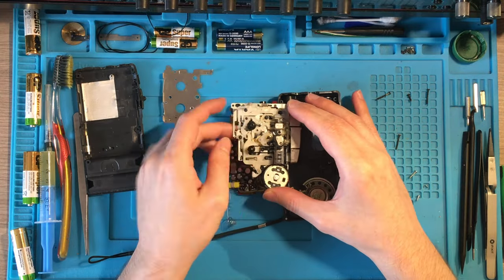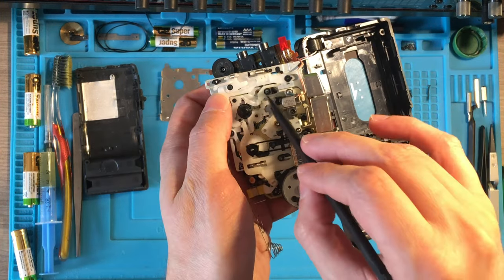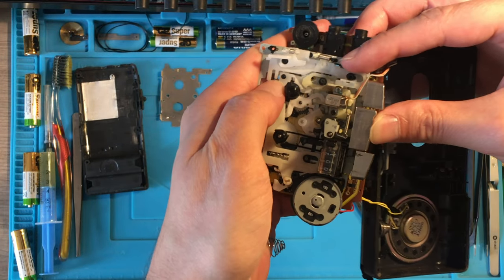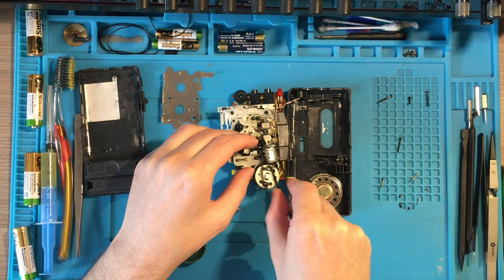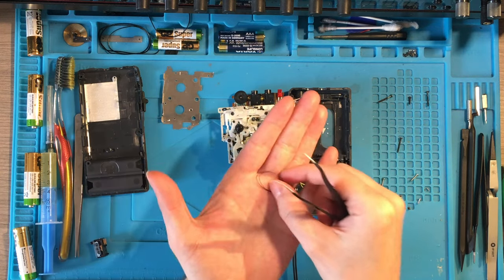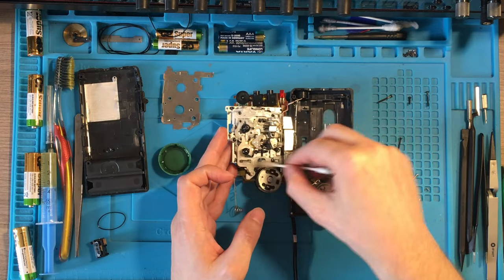After the first cleaning, I immediately went to check what was wrong with the play button, and after a while I noticed that something was out of place and the mechanism wasn't working as it should. Before understanding the issue better, I wanted to have a deeper cleaning inside with IPA alcohol and have the counter belt replaced, as this time it was in really terrible shape and ovalized.